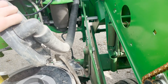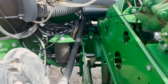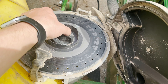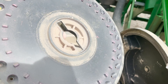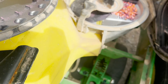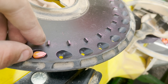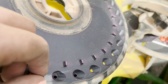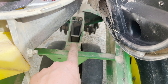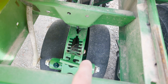Okay, so this is the vacuum line here. It goes up to this big black tube and across to all of these, and then it comes down here - this holds the vacuum. This is the seed plate. It twists on, and then you can see each little spot where a corn seed drops into. It'll suction in there and hold until it gets around and drops down in that hole right there - and that drops down.